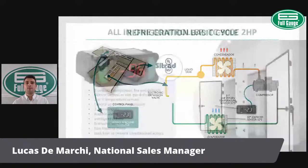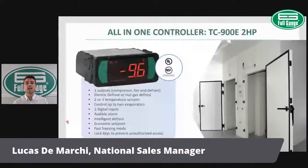So again, for those applications, we have selected the TC900E2HP, which features three outputs of control, allowing you to control compressor, evaporator fans, and defrost. The controller is equipped with two sensors. One sensor for room temperature that will be calling for compressor on and off, and the other sensor for the evaporator coil. That one will be controlling the defrost cycle.